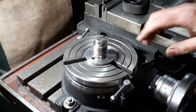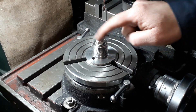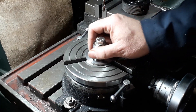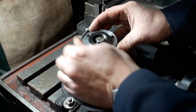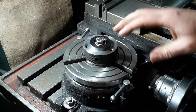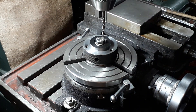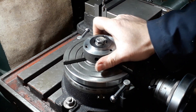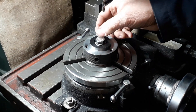So we're on the rotary table now. What I've mounted on is one of these adapters - it just bolts through the centre. There's a little lip on the inside, it's located into the two Morse taper, and this one's the Myford one. What we can do is the original back plate screws on like that, and this then gives us the ability to line up our centre hole to drill the back plate. So now we've got that lined up, it gives us the centre. It doesn't matter exactly where the three holes are, as long as it just gives us the distance from the centre.